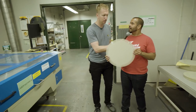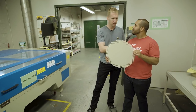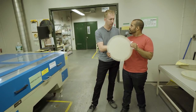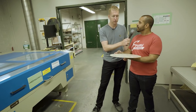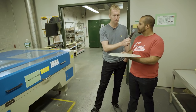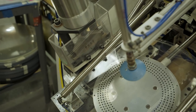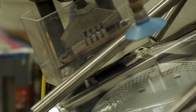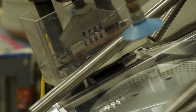It's a perfect example of some of our conga heads before they get turned into a finished product. We'll layer two of these on top of each other to create a drum head that has a very high collar to replicate the natural shape of a conga skin. Little holes are punched through around the outside edge of the head — this is where the glue will flow through inside the hoop, allowing for a strong bond.